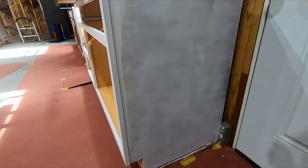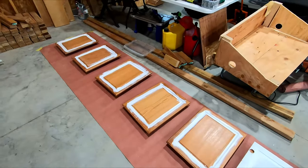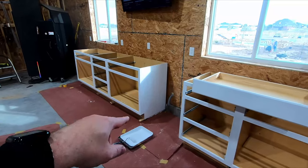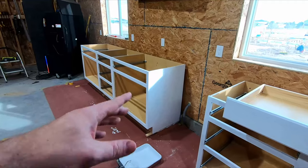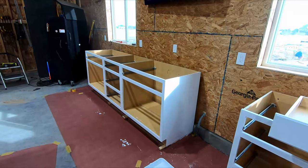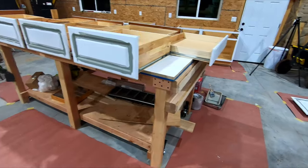That's the next morning and the paint took pretty nicely this time. I already cut in the corners and the rest of the cabinets, same with the doors. I'm going to finish getting these primed. We've got everything primed with two coats now. Interestingly, the cabinet I sanded with the orbital also had bubbling happen, but I just left it, put another coat over it, and I can't even tell anymore.